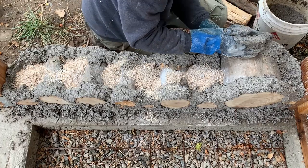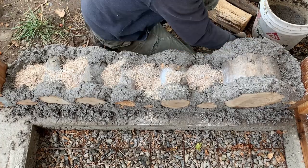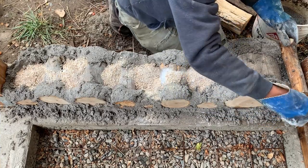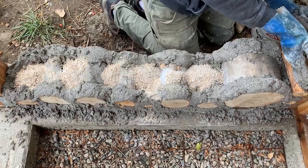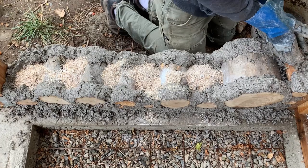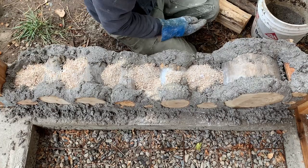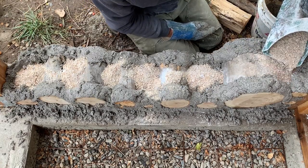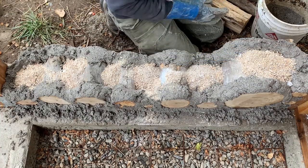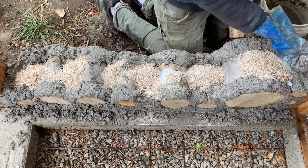I take the mortar and mound up that bead on the inside and on the outside of the wall, then place individual logs cut to nine inches, pack the mud behind them, and continue that bead. When I have the bead established, I'll take some sawdust, toss it with lime, and fill in all the holes and gaps and cracks to provide that insulation layer, then proceed to add logs, making sure I've got continuous mortar between the wood members which have screws in them to keep the wall from tipping out.